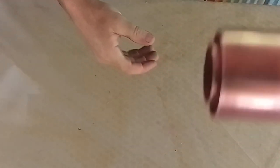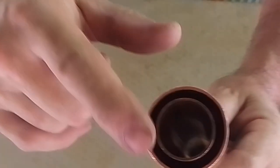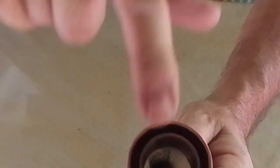So we'll want it to be just like that, because the distillate is going to come up this tube here and overflow into this tube, and we want to be able to read across the meniscus line, which is going to run right across here.